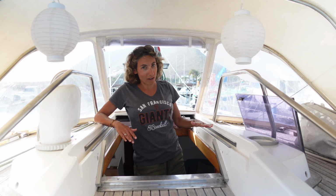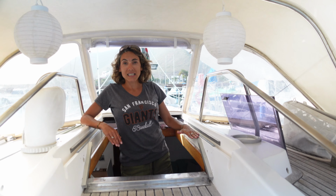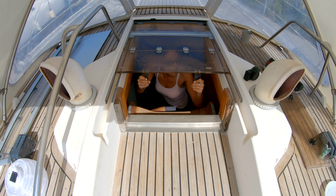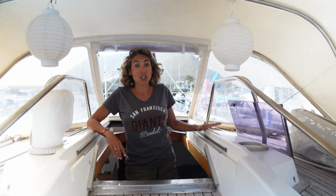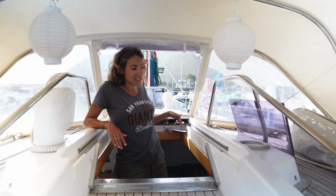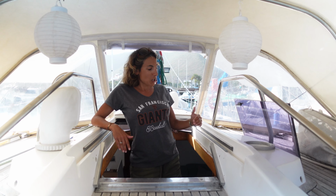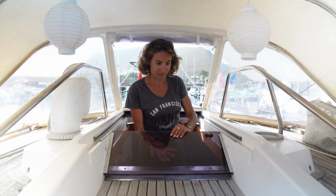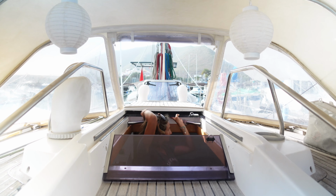Initially on Oriyo we had some issue with the companionway door. It was made in 3 different parts, and basically the rainwater just poured inside the companionway from all the edges. So we spent some time thinking about a new system, and we came up with this one. The horizontal part of plexiglass is a little bit shorter than it used to be, but it's only made in 1 part, and the small one that was positioned a little bit higher at the back end is more tilted and allows us to close it in just 1 shot.